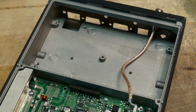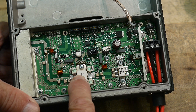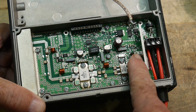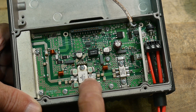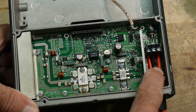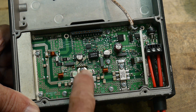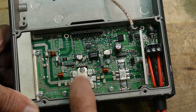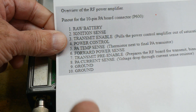In the design here there are two pre-drivers and then the final amplifier. There's a driver chip here that's good for two and a half watts, this driver chip is good to 15 watts, and then this driver chip is good to 60 watts. So: two and a half, 15, and 60. The VCC comes in here and winds its way over to this guy and goes through this big power resistor, and they measure the voltage across this power resistor to see how much current this guy is getting.